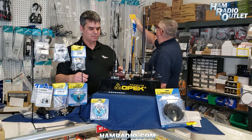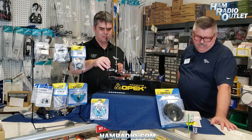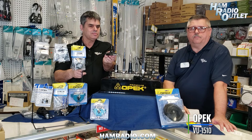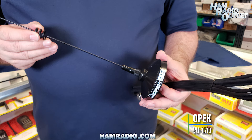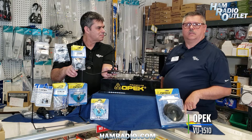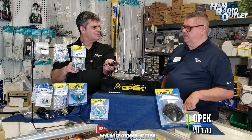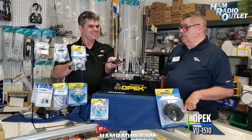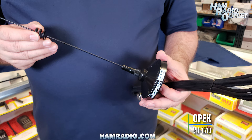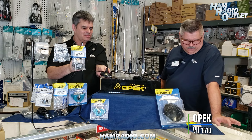The VU1510 is a dual-band pre-tuned 2-meter/70-centimeter antenna with a 3.5-inch magnetic mount. I know this antenna personally — while I was in Korea, my brother-in-law Dave, KC0CQD out of Kansas City, sent me one and I was amazed how well I hit repeaters near Seoul from the 19th floor. I've also used it mobile — it's a very good antenna with a couple dBi of gain, easy to install, great for travel, and comes with about 17 feet of coax.